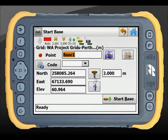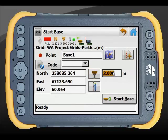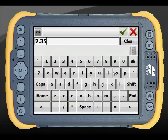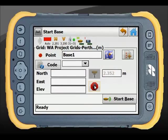If you see this icon on a tripod, that indicates it's slant. If we change it to vertical, you see it's on a pole — I get a lot of questions about that. So choose the antenna height and enter in the height of your antenna, slant or vertical, name your point, and simply hit the little man to start getting readings from your GPS base.